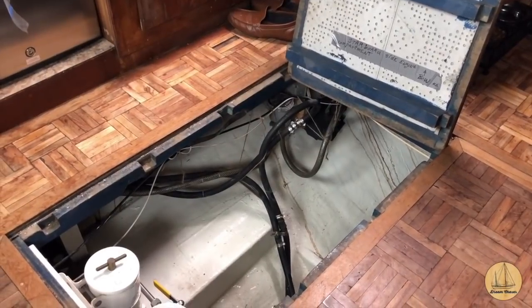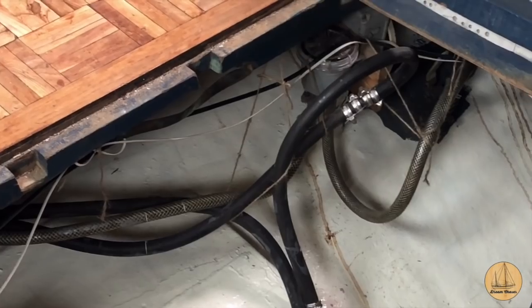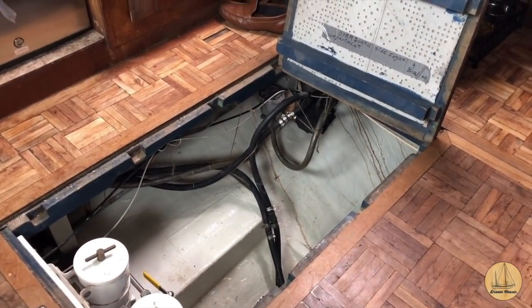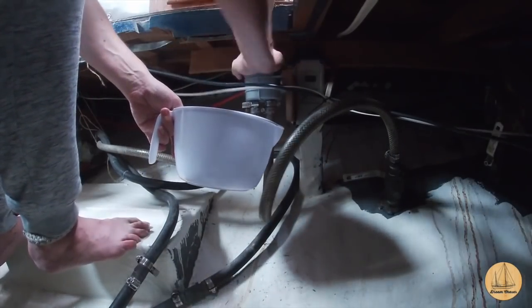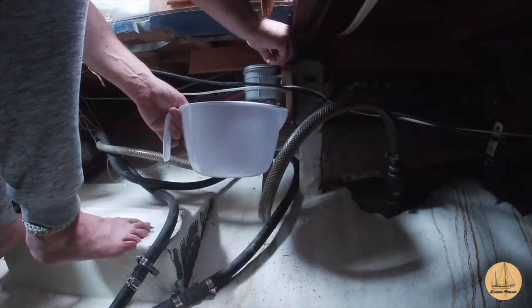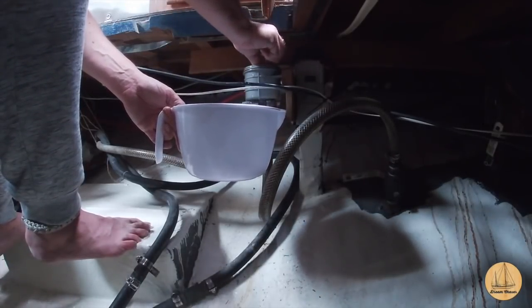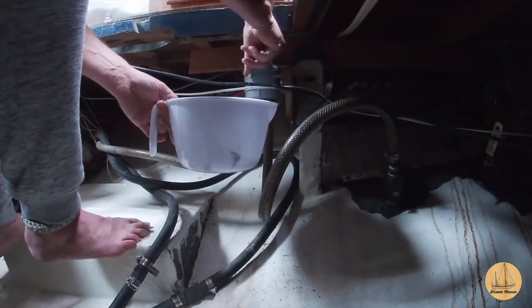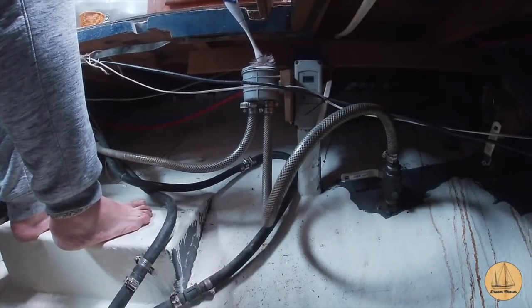Now I turn off the valve with the air conditioner pump running, go up top and look over the side to make sure I have good water flow on the discharge side. That's one done — the rear stateroom air conditioning and heat unit. Now we're going to do the one that feeds the forward air unit, located right here underneath the galley sole. Just like the process before, it starts with turning off the seacock and then getting a drip bucket. On this one it's a different style — unscrew the top and then just lift the strainer out.